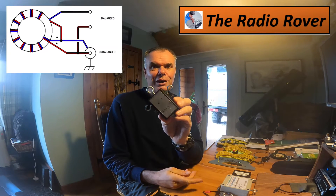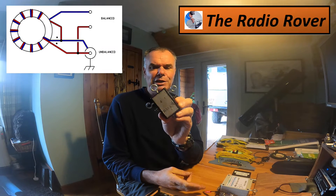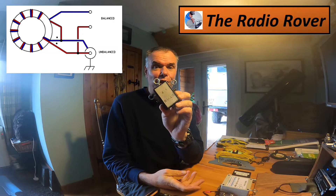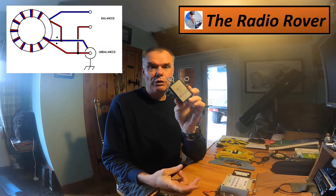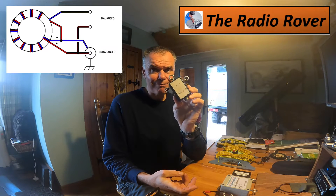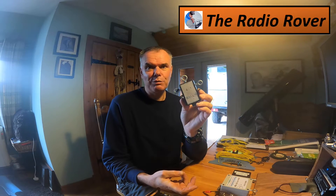If you're running a bit more power you'd want a 1-to-1 balun. An extreme example is this Diamond BU50 that I bought decades ago and have never used. Your coax would go in the bottom and the tabs are for your dipole — it's supposedly good for 1.2 kilowatts, and it's quite heavy, so it's for a beefy antenna. Your balun can also have a ratio to it. This is a 4-to-1 balun. When I first started in radio I had a W3EDP connected to this because I didn't know I should have been using an un-un instead. If you have a non-resonant dipole, this will transform the impedance down 4-to-1. It's probably a bit more limited in its use, which is why it's been in my spares box for a long time.